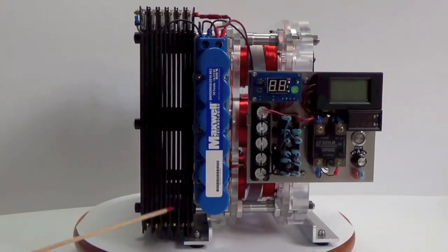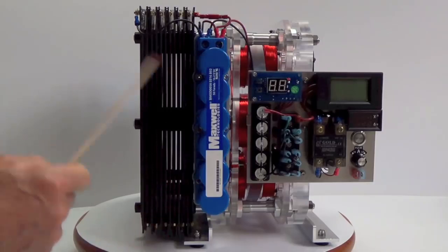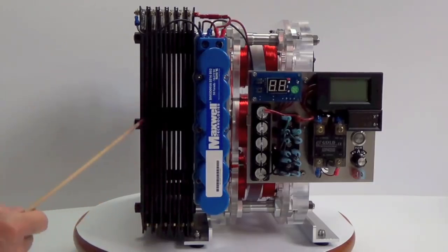So we've got a semi-solid electrolyte in there, and there is a redox reaction that's spontaneous, that's happening all the time, and then that charge is polarizing that dielectric layer and it's charging it up just like a capacitor. So it's interesting because it's like a primary battery of sorts and a capacitor combined. But this primary battery isn't one that you're going to throw away in 2 weeks or 2 months or 2 years' time. This is a primary battery that's going to last you for a long, long time. So it's very interesting the way it works.